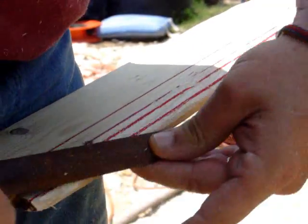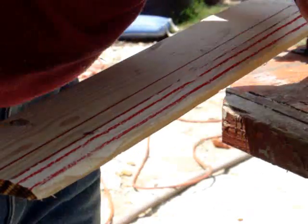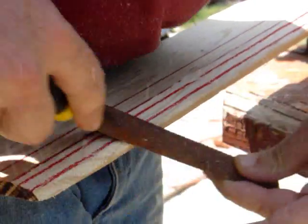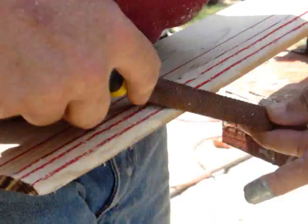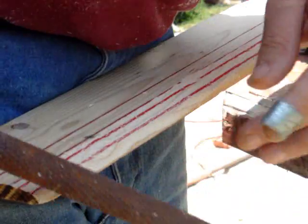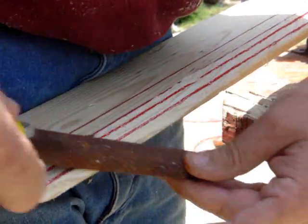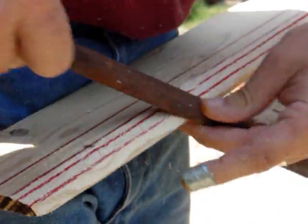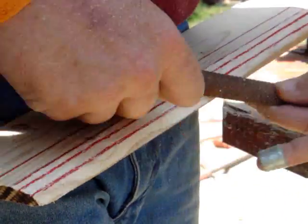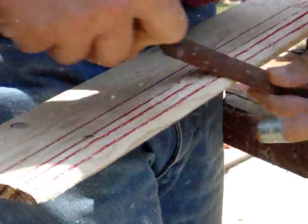These strokes you want to take them along with the blade a little bit down as you go sideways — this keeps everything pretty much consistent. Lean over the blade like this so you can see the other side and keep it against you. More downward motion like this to speed up, or more like this to keep it nice and even and keep the edge from splintering. When I get down to the very edge, I want to make sure I'm going like this with just a little bit of downward motion, and check my angle each time I go another inch. Take the most off right down this blade pretty quick.